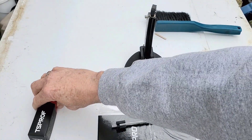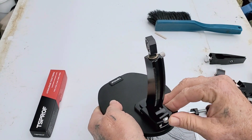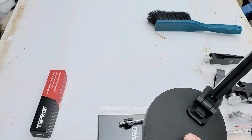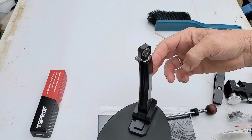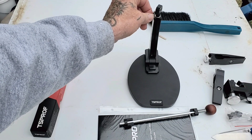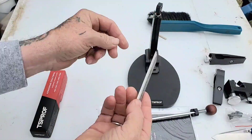So we got the stones. This guy here has a little thumb wheel on the back. What this does — after you pop this up and it snaps into place — you wheel that up, tighten it a little bit, and that keeps this tower here from moving back and forth. This is a stone compensator. What that does is: when you have a stone, before you start sharpening, you lift this up and tighten that back down — now you're compensated.